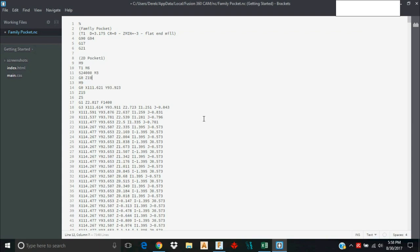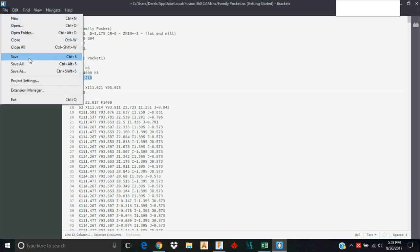I'm going to delete the G54 and replace it with G0 Z10. What this does is make sure my cutter is lifted up above the stock before I begin traversing in the XY plane. If I wasn't paying attention and had just zeroed my cutter to the stock surface, then ran the file, it might skim the cutter all the way across the stock and potentially ruin my piece if anything was not perfectly level. I'll go to File > Save.